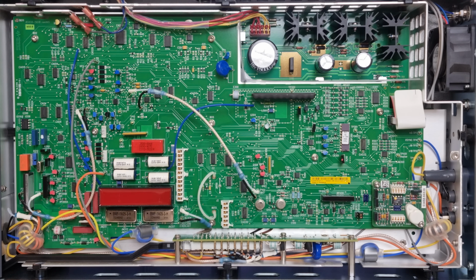The A1 board is almost entirely made in surface mount technology now. However, none of the working principles have changed as far as I can tell. Even the component placements and the reference designators have been inherited from the classic HP design. This way the public schematics remain mostly valid, and I suspect you can continue to mix and match modules of various generations of the meter to your heart's content.